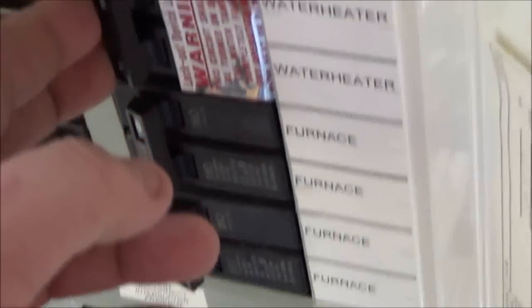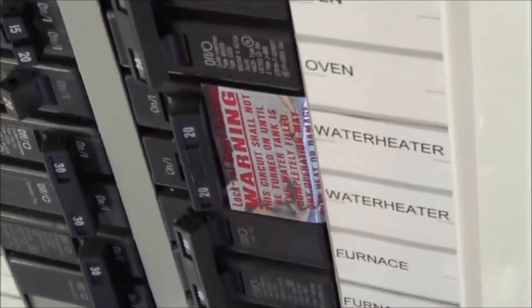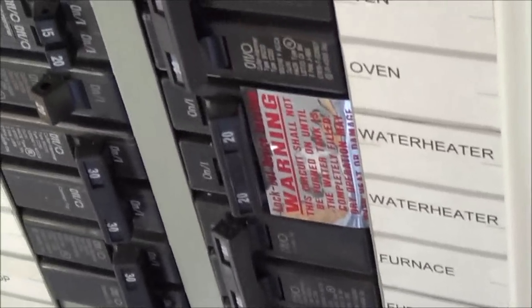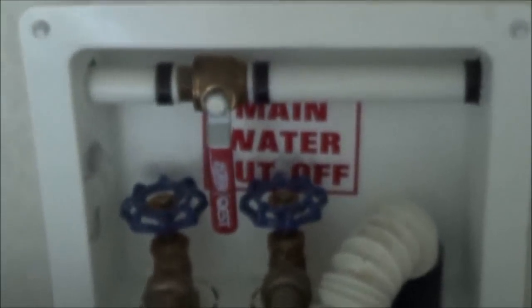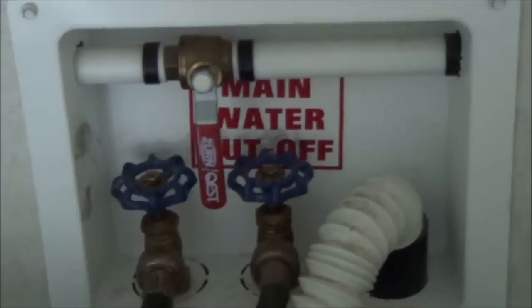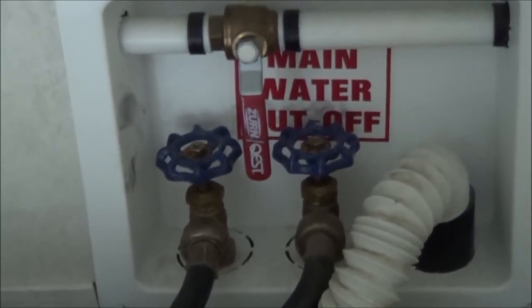In this video, I'm going to show you how to simply flush it out. The first thing you're going to want to do before you flush the hot water heater is turn off the power to the hot water heater. Next, you want to use up all the hot water. Then cut the cold water supply off. Some hot water heaters do have cut-off valves at the hot water heater — you'll only need to cut off the cold side.